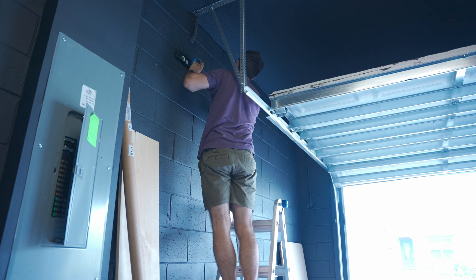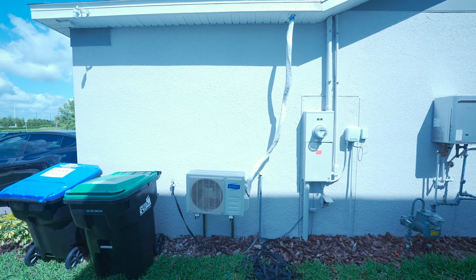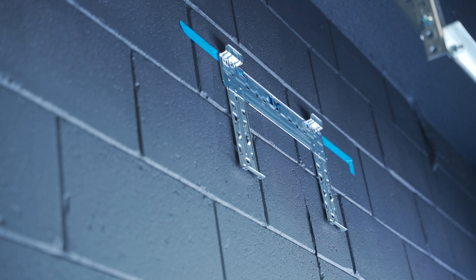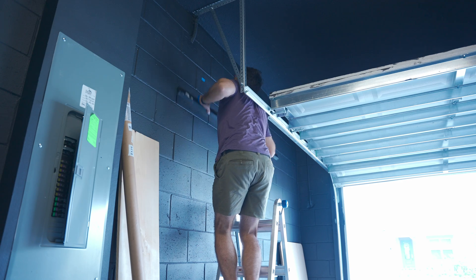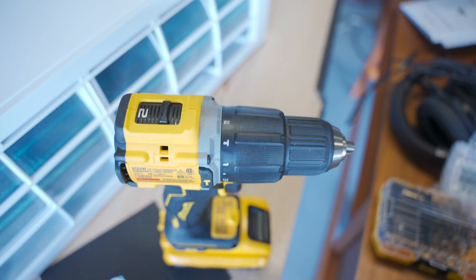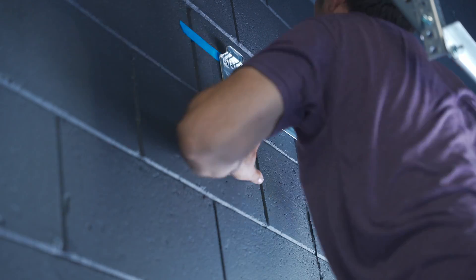First I picked a spot on the wall. A heat pump will be most efficient higher up on the wall when cooling — that's where all the warm air hangs out and we want to pump that heat out. I'm only going to use this for cooling because in Florida it pretty much never gets cold enough to turn the heat on. I chose a spot that had power nearby and reasonable placement for the outside unit on the other side of the wall, which will be hidden by my garbage cans and eventually a bush. The unit came with a bracket that's basically a french cleat — once this metal thing is on the wall you can just plop the blower on there, no tools involved. I leveled it out, taped a line, used a Tapcon bit on a hammer drill to punch a few holes. These Tapcon concrete anchors can hold literally hundreds of pounds per screw — they're blue, easy to find on the shelf, and come with the right size bit in the box. I only used three screws even though the bracket is riddled with mounting holes.